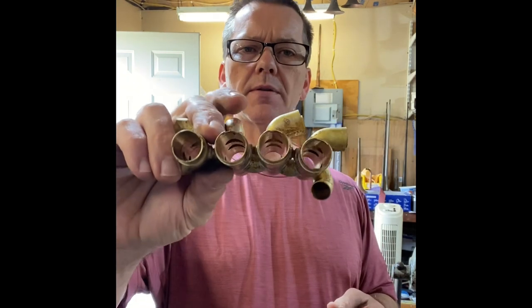Okay, all the valve bodies are done. They're brazed. The machining is done. So you can see, hopefully, through them now. There are four steps in the opening. A hole saw and then three reaming steps to get them to a specific size. Once they're at that size, they're not at the finished size to put pistons in yet.